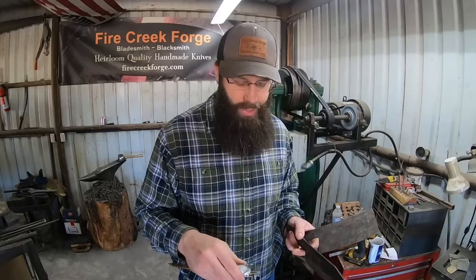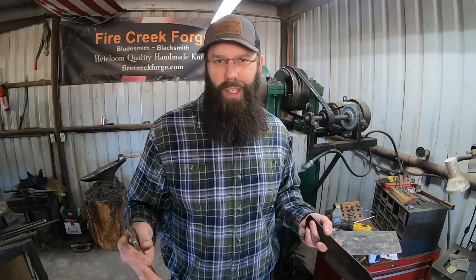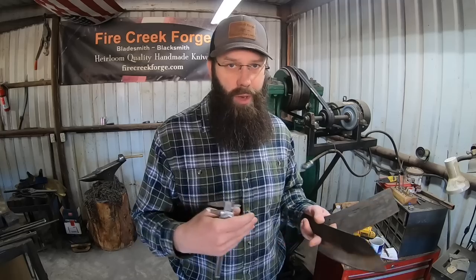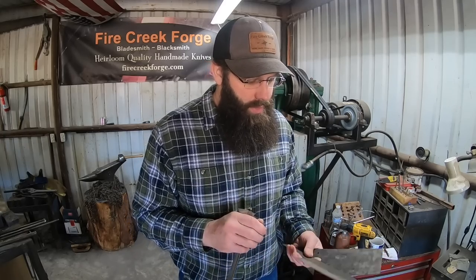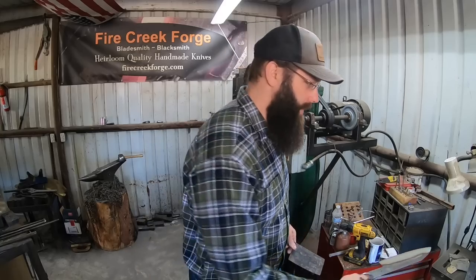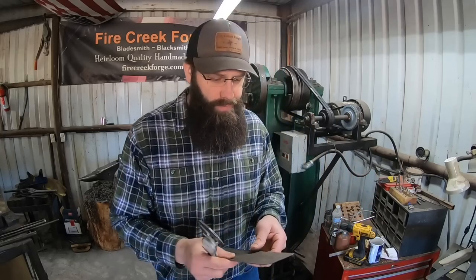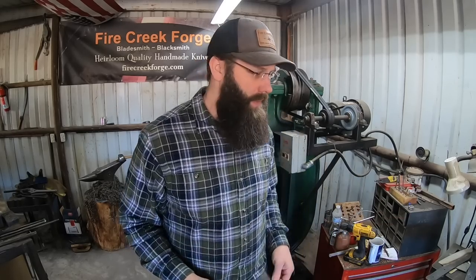It's very useful understanding how that all works, but you quench your blade to a specific temperature, say maybe 600 to 800 degrees, and then you don't leave it in the quench. You take it out, and that steel is going to convert at that point to martensite over the next period of time, but you have a window of opportunity there. So the warping that we're having here is due to the steel retaining a memory with that aggressive forging that we did. And granted, my methods to spread that steel out are maybe not super conducive to a relaxed piece of steel. So I recognize all that.